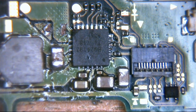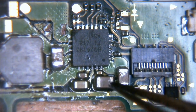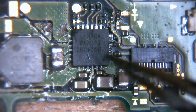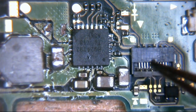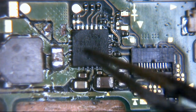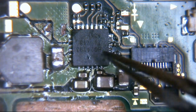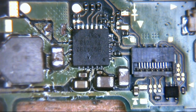What essentially happens is the voltage that's either going in or coming out gets stored up in this capacitor. Okay, and because it's stored and it has this little path to ground here, those little spikes come out the other side really smoothly, really flat. The other side is just to complete the circuit. So essentially it takes those little spikes, those little bits of up and down, which might cause havoc, and it smooths them completely flat. Okay, so it has no noise, it's allowed to do what it needs to do, it's important for timing and everything else. Beautiful, that's what happens.